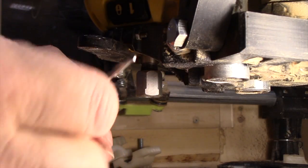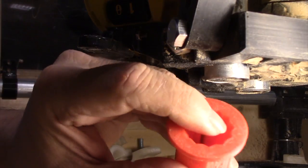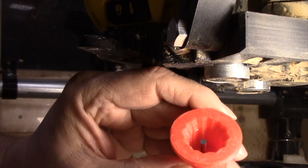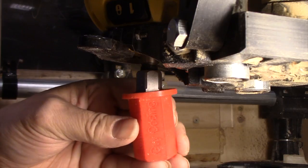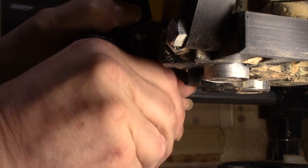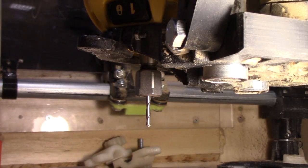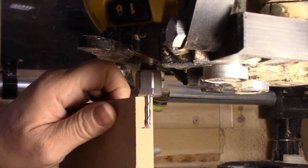I can hardly see that, so I'm going to put it in the hole in the middle and wiggle it around until it kind of locks into the detent in the center of the adjuster down there. It's mostly centered — we'll just find the collet hole here, slip it back up in there, snug it up a bit, not so tight I can't get it out. And there's the round nose bit — it should be at the same height that the other one was at.